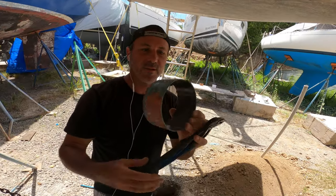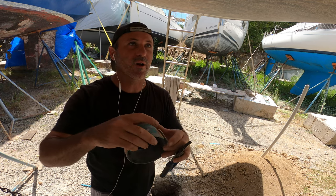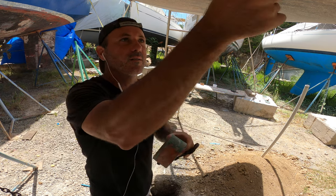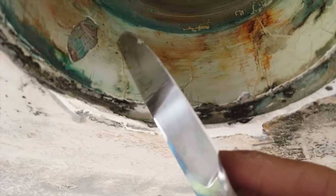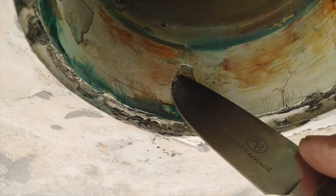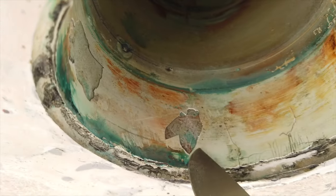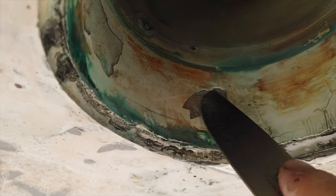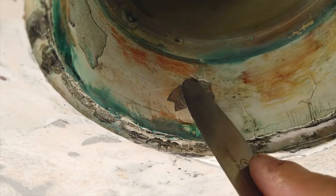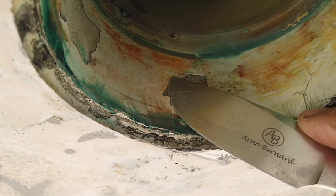There it is — came right out. As soon as I broke the seal on the end, it just popped right out. Now I'm cleaning up the surface area that the bearing fits in. You can see there are a bunch of cracks. I'm pretty certain they just put a thin layer of gel coat to make sure the bearing fit nice and tightly. I'm going to replace this surface with a two-part epoxy — West System 105 with 207 activator and a 407 filler. It's a sandable, really tough, really dense sandable filler.